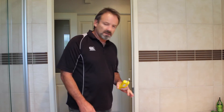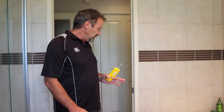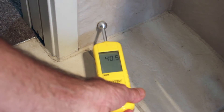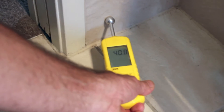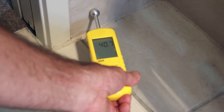Don't use your moisture meter inside the shower area. Take your base readings on your tiles first at a comparable spot in the bathroom. We want to check outside the shower area so we know where the water is coming under the tiles and escaping from the shower or not. So we're going to take a base reading on the opposite tile on the opposite side of the door first. Tiles often do increase the reading slightly, so this base reading is 40 — 40.1.